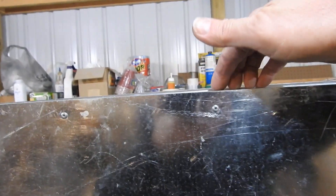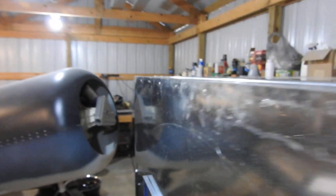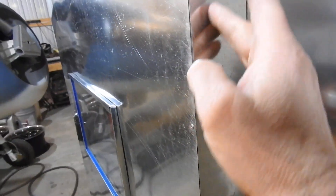The only place I can feel just a little bit of heat coming out of here is all the way down the hinge. I feel no heat where the heating elements are — it's completely cold to the touch. The door is completely cold to the touch. Nothing anywhere is warm. Cabinet top — I don't feel anything getting hot. I can just feel a little bit of heat leaking out of here because it's probably not a really tight seal. This cover may get warm because it literally wraps around, and this is the inside skin. If anything gets warm, it'll be this side because this goes in and around, so the inside can actually heat all the way through here.